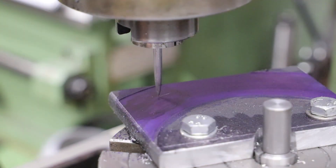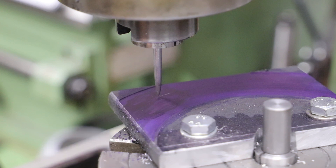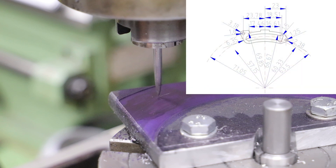My overall approach here may appear to be a little bit convoluted. As I progress through making these parts I frequently swap between Cartesian coordinates — that is straightforward X and Y on the mill table — and radial coordinates taken with respect to the centre of the rotary table. I can do this so easily because, as I normally do, I converted Don's design into a CAD drawing, making it very easy to vary my reference point.